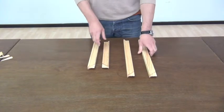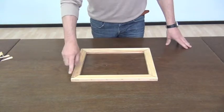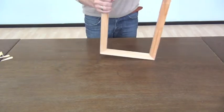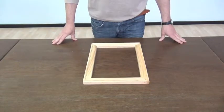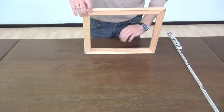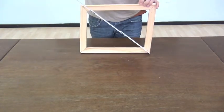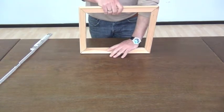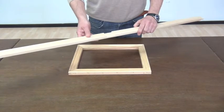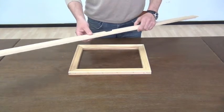Just assemble it. The next step would be to close the gaps. Once you've done this, we want to check the angles — for this, we take the ruler. With a frame like this, one diagonal is shorter than the other and you have to move it to correct that. For larger frames, suppliers recommend using middle pieces like this one to make a cross in the middle and have the wedge frame more stable. Use them — they're not too expensive.